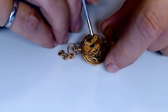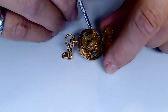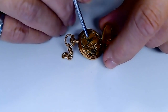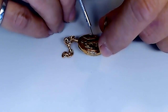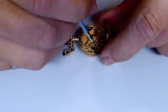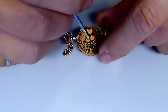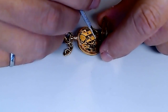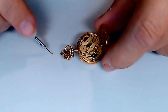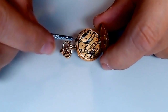The winding mechanism comes through here and the mainspring is under the plate. There's a center wheel with no jewel on it. Going down the train, there's a jewel on the third wheel and a jewel on the fourth wheel. The escapement is actually underneath the balance bridge. There's a screw to take the escapement off, and a fairly simple push-left push-right regulator arm to regulate the watch.